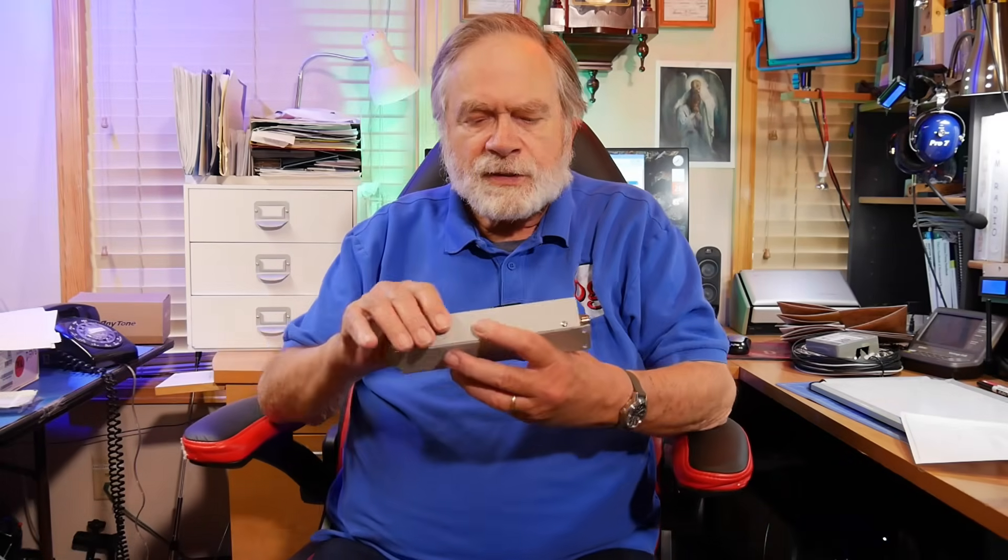When you're dealing with UHF/VHF, you've got to remember that you're dealing with stuff that doesn't always want to stick to the inside of the coax cables. This right here is an example of an RF attenuator. If you put a powerful signal into a spectrum analyzer that's stronger than 10 dBm — which is one one-hundredth of a watt — you risk breaking the spectrum analyzer. That's what the attenuators are for. I just got this one, ordered it using channel funds from Amazon, and we're going to be doing a video on this and testing it.